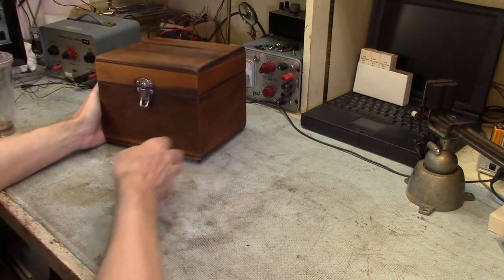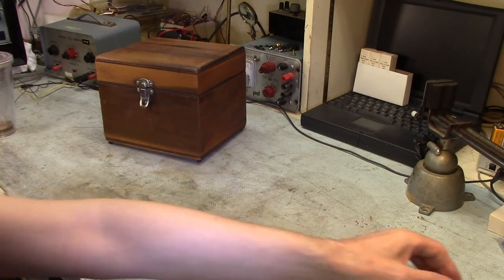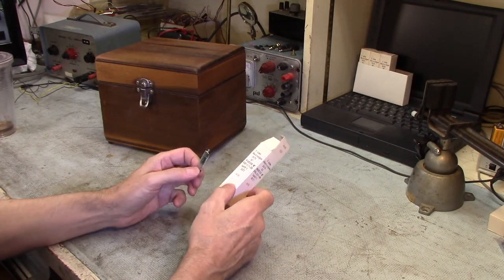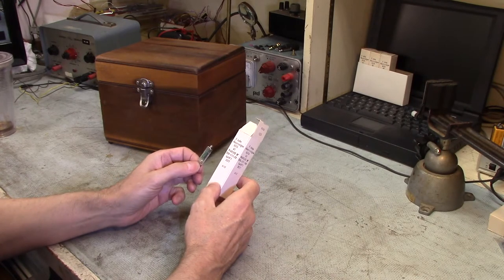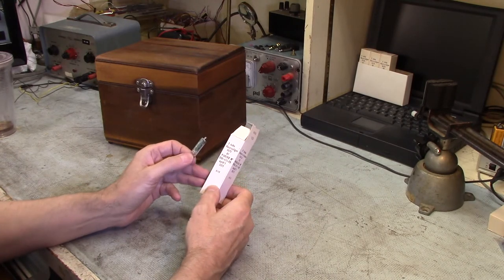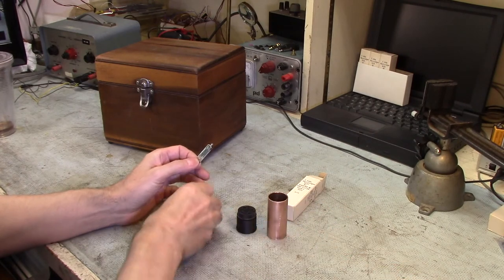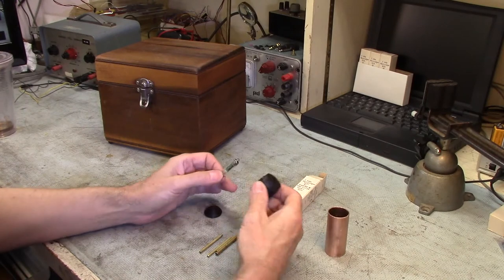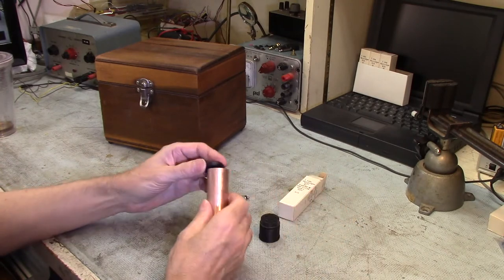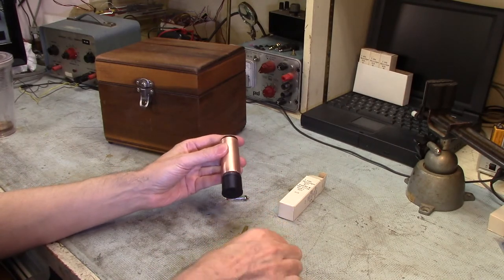So the conundrum is what to do for a tube. Looking on the internet there are about a dozen potential alternatives for making adapters that will work comparably to the Westinghouse WD-11. The one I've chosen to try is this little super-miniature tube, the 5676. The idea is to come up with a mock-up shell — ABS printed plastic, high temperature so the heat from the tube probably won't bother it — along with copper tubing, a cap, some resistors, and brass tubing to form the pins.